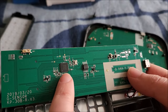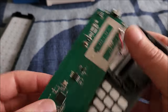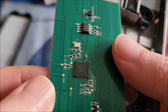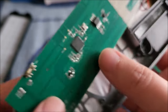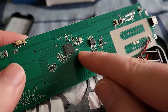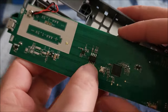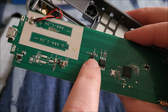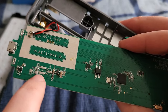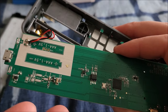In terms of parts: there's a transistor, probably to switch the backlit LEDs on and off. The main chip is a YC1026. There's a chip antenna for Bluetooth, a crystal for that, what appears to be a serial flash chip — probably configuration or firmware storage. Another chip that I'd guess is related to power regulation, and a little bit of circuitry I'm guessing is for battery charging. There's also a small regulator.